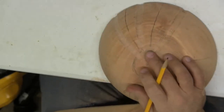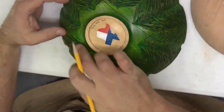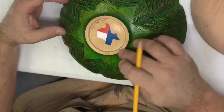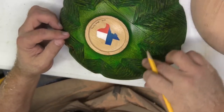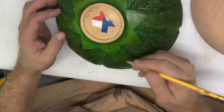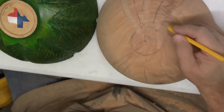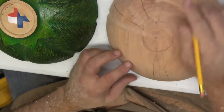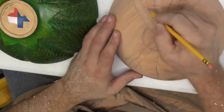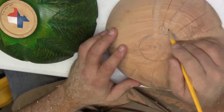And when I have a foot, one of the things I'm working on is trying to get a pattern. Because on this particular one, you can see the points almost like a star. Okay, so I've got my foot. I have another circle around on the star that keeps it pretty much the same distance. Then I come in and I make my marks, just like I did right there. I got this. And so by doing this, I can set my angle. And it creates that star, because I'm trying to decide what pitch I want my cut to be on.